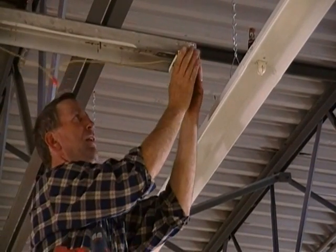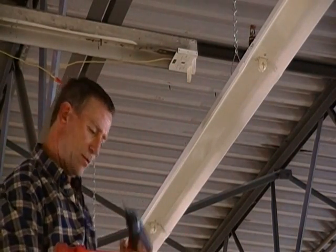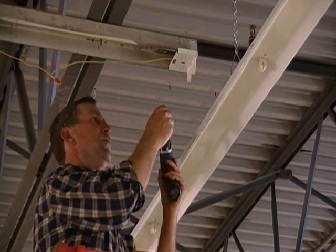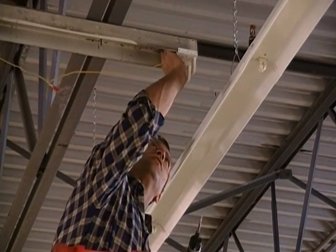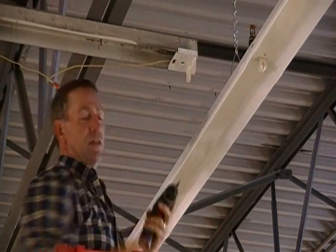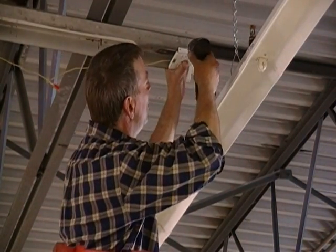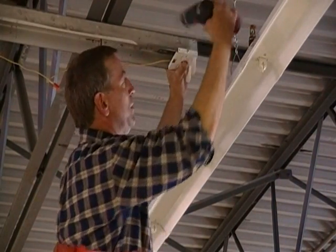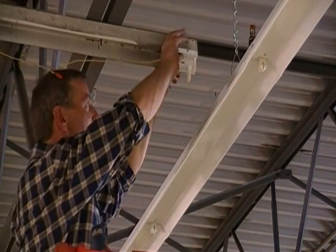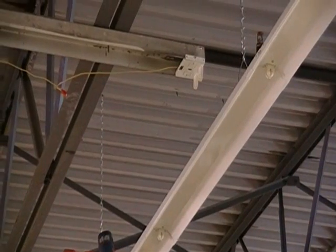Fixture width and attach. Squeeze it together and fasten it to the fixture with the self-drilling screws that are provided with the retrofit kit. Make sure you're at the end of the fixture and attach each side of the conversion kit. Facing is important — you'll want this straight to the end, then make the necessary adjustments to properly align the lengths so they are centered.